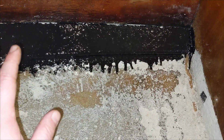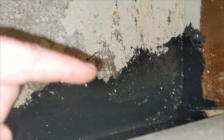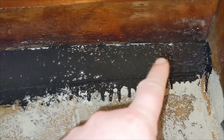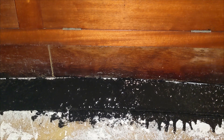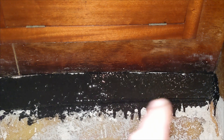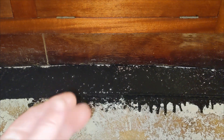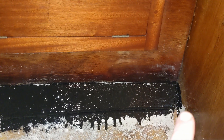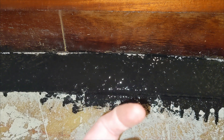So this absolute mess that I've made — I've used the black rubber paint that I used in the anchor locker to seal this bottom corner, and then I can monitor the amount of water that goes in it in 24 hours. Because this stringer is a structural part of the boat — these are all glassed in, so they become part of the structure and strength. This is quite a long area with no bulkhead or anything until you get back there. The stringer gives it some structural rigidity across there near the waterline. The stringer was drilled with holes and all the little tiny holes were wet with salt water. So I've painted it in the rubber paint just to see if the holes push the paint out and water seeps out of them before the paint dries.